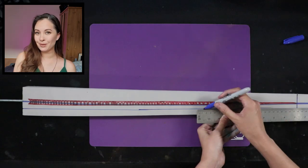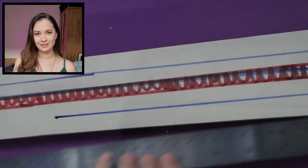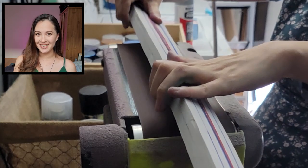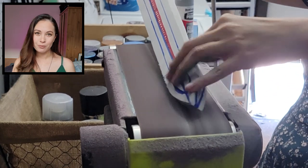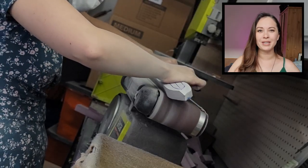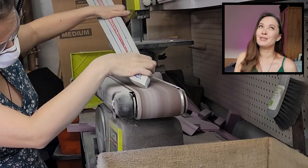Next up is shaping the blade, which I'm going to do on a belt sander because it's fast as heck. I'm marking the halfway point between the fuller and the edge of the blade. I'm going to sand down this outer half to give it that lenticular curve and give the blade a nice sharp edge. Now it's sanding time, and slow and steady is the way to go. I'm using large, smooth movements and steady pressure — first sanding off a lot of the mass on the edge, then moving back and forth for a curved, smooth shape. And of course, eye protection and a respirator are an absolute must.